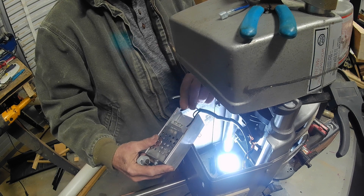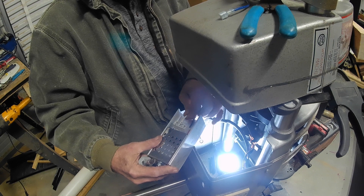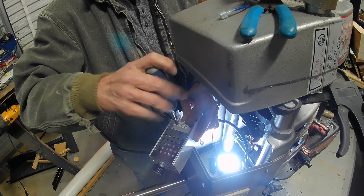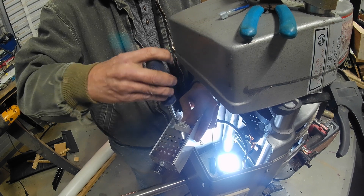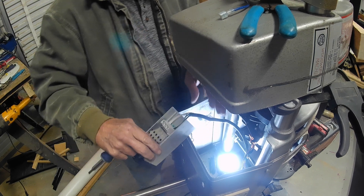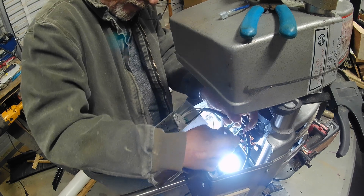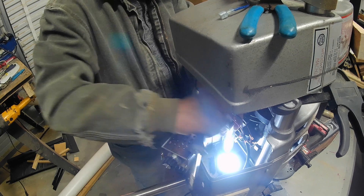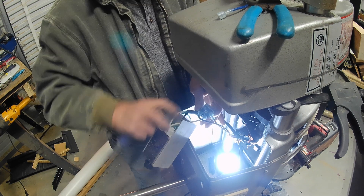Okay, what I've got here: I've got hot coming in, I've got common coming in, and then I'm going to bring common out, so I'm going to loop them together right here in the box. Sometimes they have four terminals, sometimes they only have three — this one's a three. Tighten that up and make sure it gets good and snug. Don't over-tighten it. Now we've got one more wire to run — we've got to plug this one in to the AC terminal, and then one more wire from here to here.